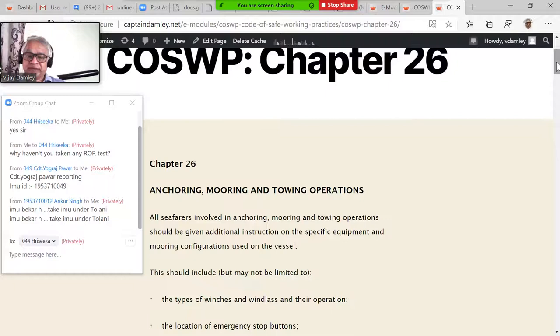Now, when I do that, there is a man who is handling the brake. One man handles the brake. He is generally the experienced person, the bosun. The chief officer or a duty officer, or whosoever is in charge, will be standing clear. He will be looking at the anchor by putting his head overside just to ensure that nothing is around. And he is in touch with the bridge on walkie-talkie or an internal system. You can have a loudspeaker and microphone, one of the systems.